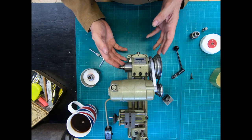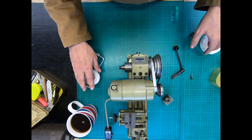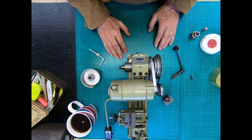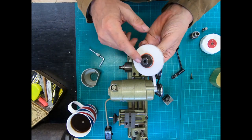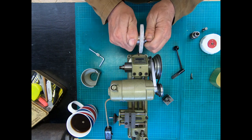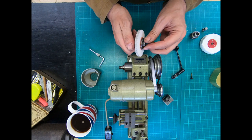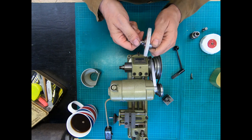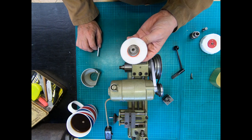The Unimat can be a lathe, a milling machine, we can polish on it, grind on it, cut threads - we can do many things on this little machine with small components. One word of warning: if you buy grinding wheels on eBay, I won't use the one that came with it just because I don't know the history of it. You're far better to just buy new ones - these small ones aren't that expensive, and it's better to be safe than sorry.